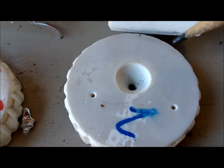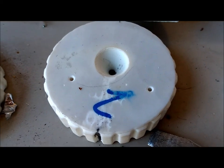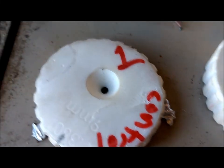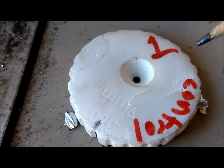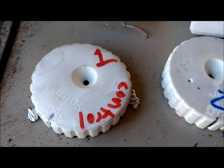This one here, when I took the lid off, the sprue just fell out by itself. That shouldn't be a problem — I think if I put a mold release on the mouths of that, it'll completely eliminate that. But here's the real surprising thing: I expected number one to be browned up worse than the cavity. But apparently I was holding my mouth the right way when I was pouring this particular one. Anyways, back to the casting — I'm on round number three.